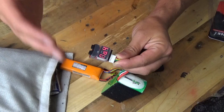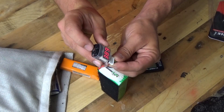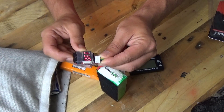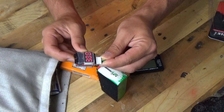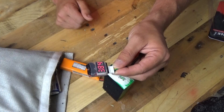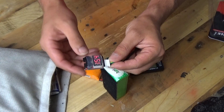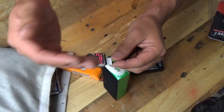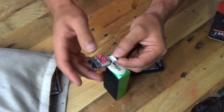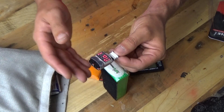and it will then walk its way through the different cell voltages. Also with this battery tester, what we can actually do is put it in the model itself. By pressing the little button on the very top, you'll see that we can set the voltage alarm. So maybe you want the alarm to go off when you reach 3.6 volts as you're flying around — if the battery sags to 3.6 volts on any of the cells, the alarm goes off. It's fantastic because it's small, it's light, and it does work in an RC model.